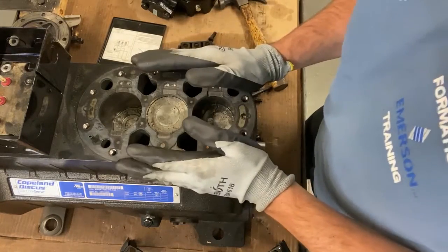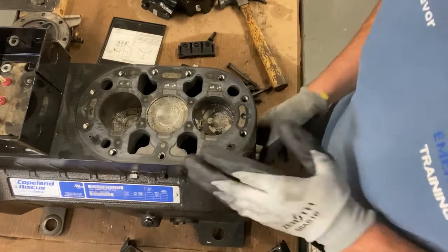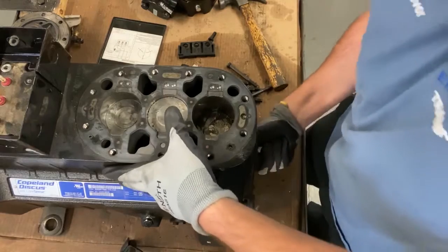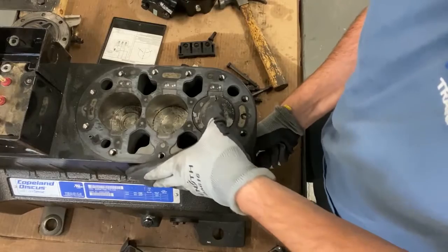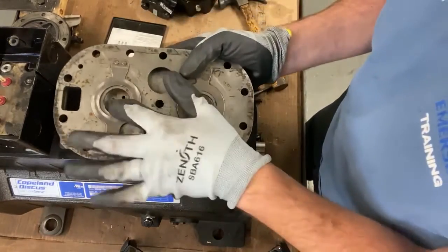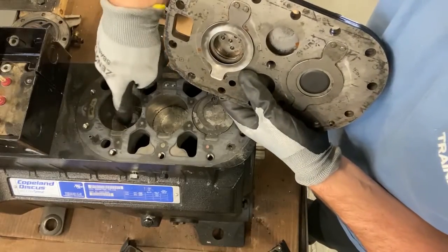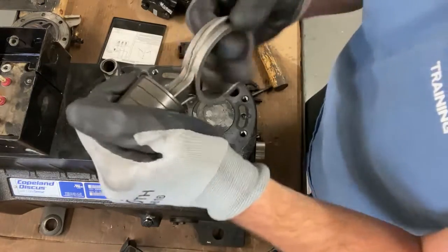The other check you want to do before you finish, now that you already got the pump out, is the wrist pin check. And how you do a wrist pin check, you put it up top dead center, turn it a little bit, and push down. So it didn't drop there. Didn't drop there. And didn't drop there. Like I talked about earlier, if you get a slug and it takes out the discharge, you have that discharge pressure pushing down on the piston, right, like that. What will happen is that you get wrist pin wear.